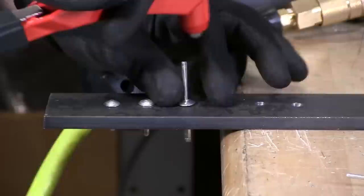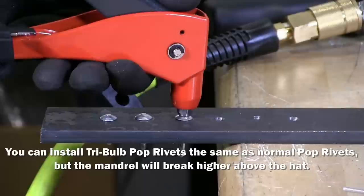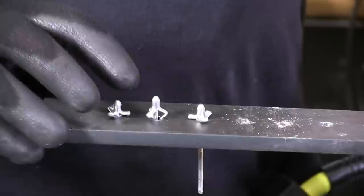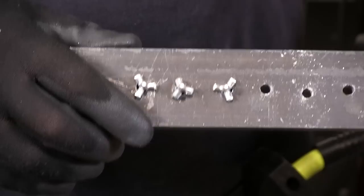I'm going to insert the rivet. I have my rivet tool, and you don't install these like a normal rivet — you don't keep cranking the rivet tool until it snaps, but you do want to snug it up to the backside. As you can see here, that's correctly installed, and that is incorrectly installed. You can see that it's not totally up against the backside, so you want to make sure that you install the rivet properly so you have a nice tight fit.